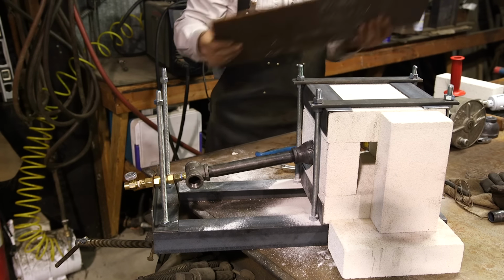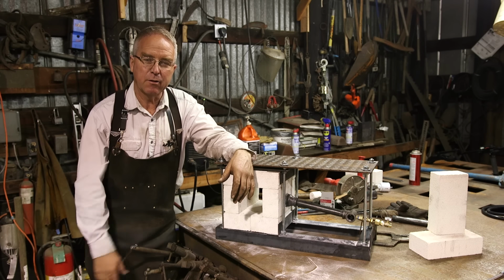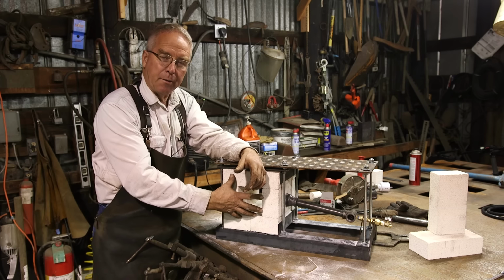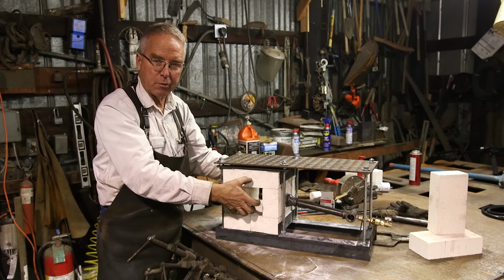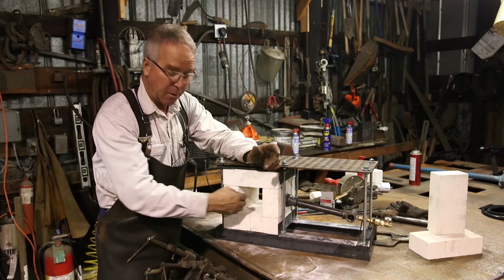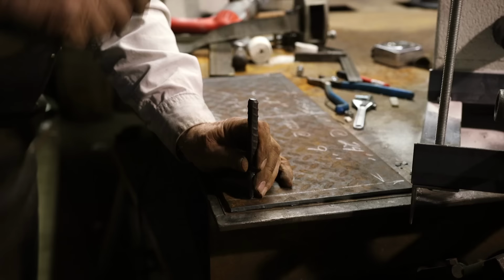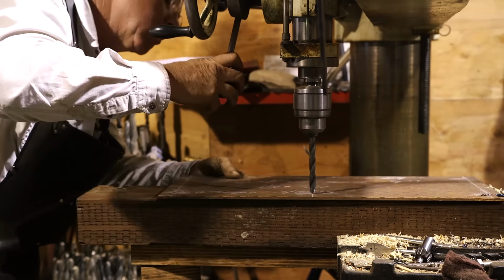6 more holes. So I think for a little bitty forge, easy to get into, satisfaction of building it yourself, I think this is hard to beat. The bricks will deteriorate. They always crack in the middle, but they're captured so tightly that the cracked bricks can't fall out. When the time comes that the floor is degraded because you've been doing Damascus or just scraping in and out, you can take this thing apart, put in a new set of bricks, put it back together.